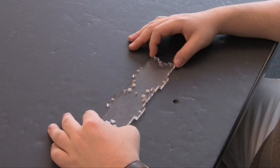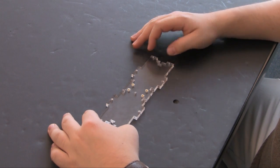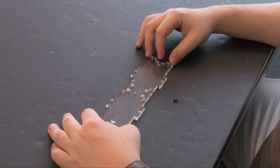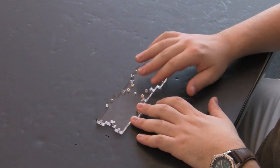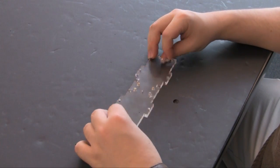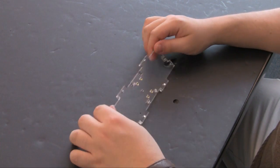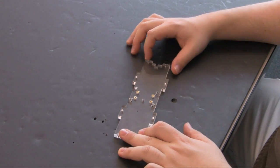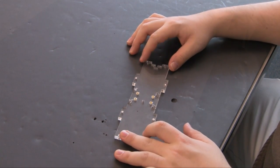This is the Z-table support plate. It requires four M2.5 thermoplastic inserts. These inserts must be flush with the surface of the part for later assembly. It does not matter which side the inserts come in on, but be consistent. Make sure to leave this center space empty, as it will be necessary to put a screw through it in later assembly.